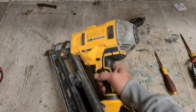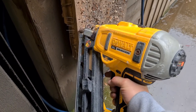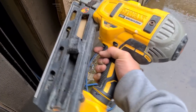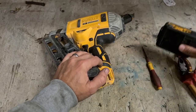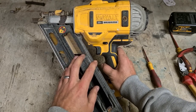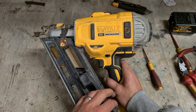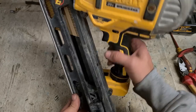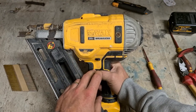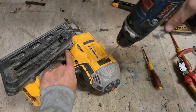Let's see what's wrong with it. You hear that constant click, click, click — you'll hear it all the time if you're used to Dewalt guns. That's either the pin or the axis worn out. The motor starts, does everything it's meant to do, you pull the trigger, but you just hear a clicking sound instead of it firing. That's generally going to be the axis or pin — or springs, mind you.